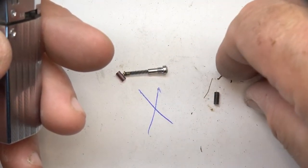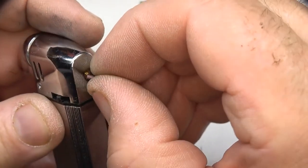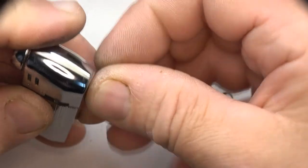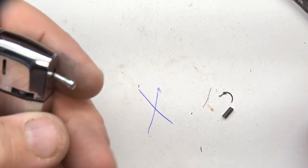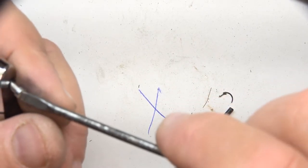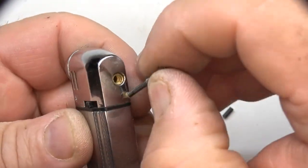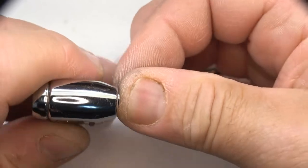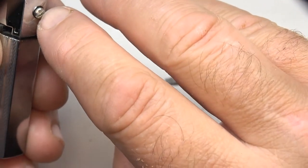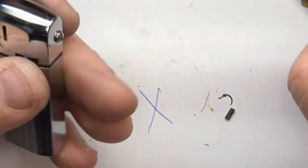These aren't necessarily a hard lighter to work on. It was hard for me prior to getting the proper O-rings, because most of the O-rings they sell in the United States are 1 millimeter cord size. There are only a few sellers with a 0.67 or 0.68 size, and they're a certain diameter, so you can't just use them for everything. I spent more than a year just trying. I emailed at least 10 of the top companies and spoke with people over the phone here in the United States, and they have these small cord sizes on their website, like I needed.